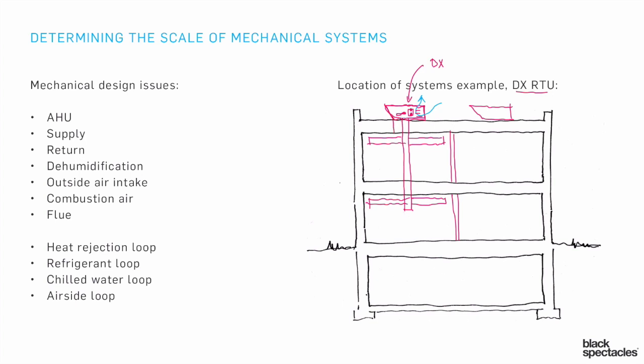There are any number of different layout options, but the biggest issue is that a great big chunk of space is taken up by vertical shafts, because you have to get all of the air from the air handling unit on the roof down into whatever floor you're going to. With two floors, you'd have two tenant spaces' worth of air going down through that floor, so there's a big chunk of space on the second floor that you can't rent or use — it has to go straight through.